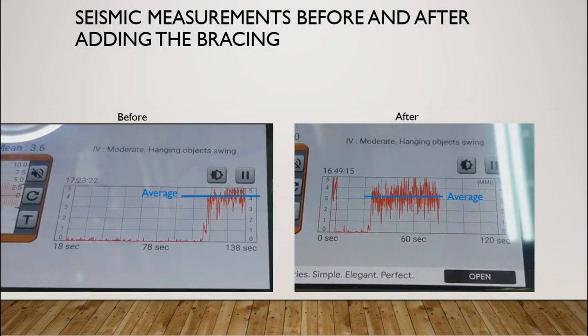As a final summary on this: on the seismic measurement tool, the average measurement probably went from about 4.1 or 4.2 down to about 3.1 or 3.2, so it's a measurable difference. It's interesting to see that the peak values — the peak-to-peak values — seem to have increased a little bit, but the average level of vibration that's continuous throughout the toolpath running has been reduced. I can see about the same impact both watching the dog holes in my spoil board, watching the glass of Coke waves, or just feeling it.